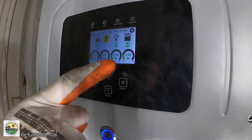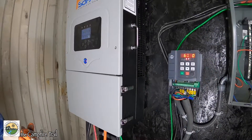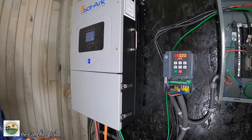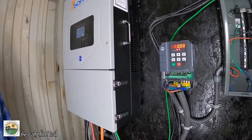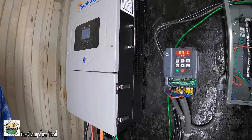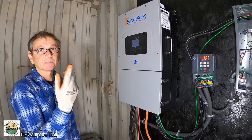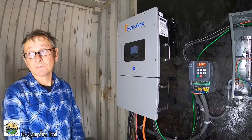If you had a regular pump, it would just be bang, and that would shoot way up — and that damages components in your inverter and everything else. So from the time you pushed that start button, the pump did start to turn — it just slowly started, just building and building. And we might have water out there now. We do have water out there now.